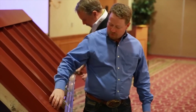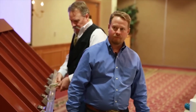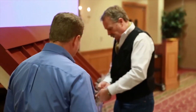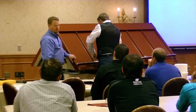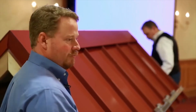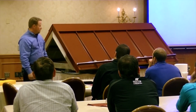Another thing that guys like to do is they want to put a snow clip right here. That doesn't work either on a cantilevered end for the same reason. Unless it's a snap. There are cases which I have seen, and it doesn't happen often, where you're at the edge of the roof and they happen to have a walk door right there underneath. The only time it's a problem is when you get snow that doesn't build up high enough to get caught, or after it's melted down, but then you will get some snow coming down. So what they did is they made a piece that could go here where they could actually attach the bar into their ridge, into their rake. So that is a ColorGard assembly.